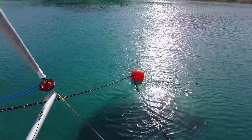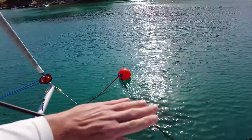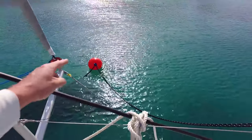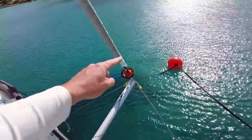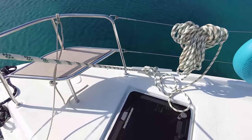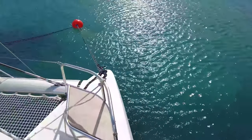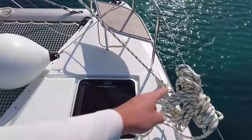It's not going left and right like a monohull. When you go left and right you get much bigger force - the boat's sides get more exposed to the wind, so much more force on the anchor. We have one rope going here and another there, which is perfect. But if we didn't have these cleats, we'd have to use this one, and the problem is the rope goes around the boat scratching the hull - causing crazy noises inside, basically impossible to sleep.